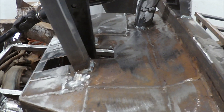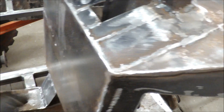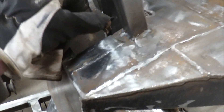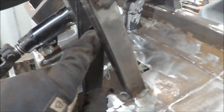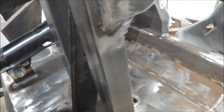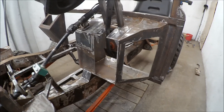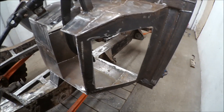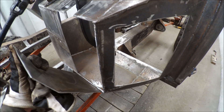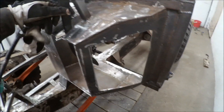If you see the movement of the pedal here, the stroke was not enough for the main brake cylinder. So I have to cut here and open up and make this a bit wider so I can get the full movement on the brake pedal. The fix here — the main cylinder is supposed to be attached to this piston and has to be 40 millimeters — but if I put it here in the best position it's slacking about 50 millimeters, so I must move this one a bit further. It turned out to be quite a hole here to fit the pedal.